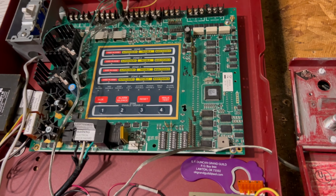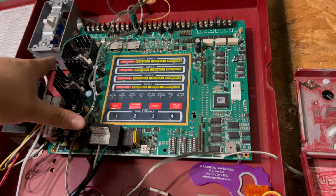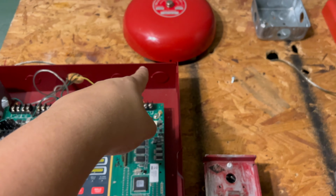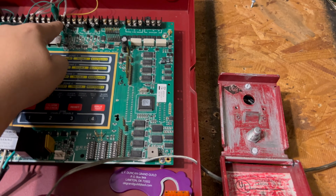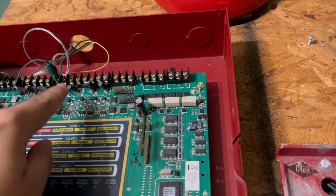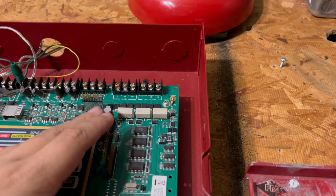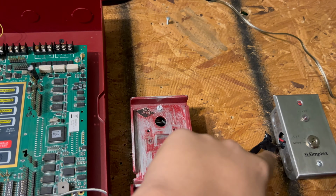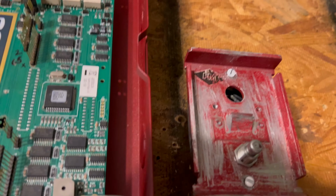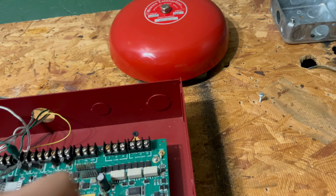So inside the cabinet for my currently non-functioning MS4, got the wire for the old Vivint panel coming in, going up to the switch, which directly supplies the positive wire to the bell. And then I'm using the zone, since even though the panel is off, the zone is still connected together, or you're still able to, the circuit can still get completed, so yeah. So wires from these pull stations come out of here, one wire goes in, one wire goes out from the two pull stations, come back in here, complete the circuit, sends the negative power to the bell, and sets it off.